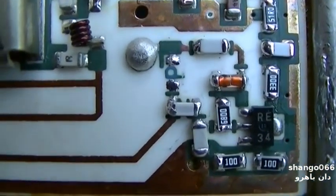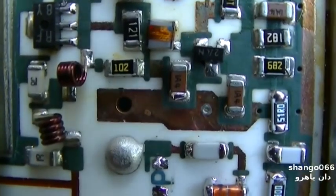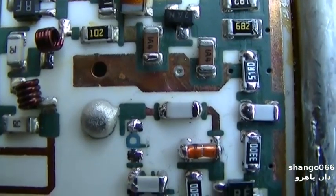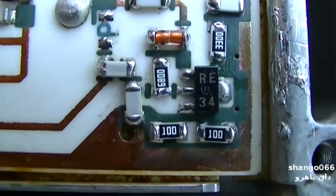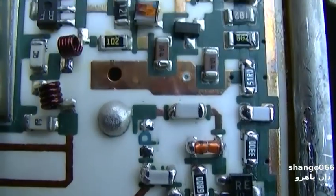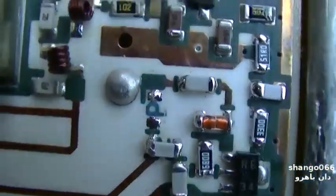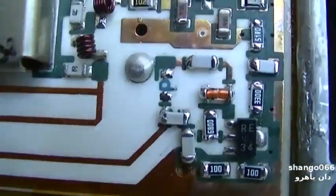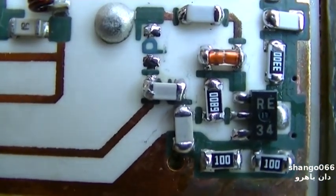Here's what it looks like with the flux all cleaned off — it looks like it came out okay. It's tough to get things down flat when you're soldering each side separately. I used a little lacquer thinner. I took the band marking off the diode there, but it's definitely on right. The signal strength test will be the determining factor whether I did it right.